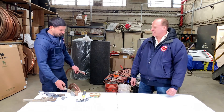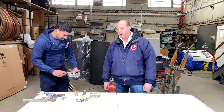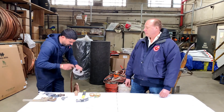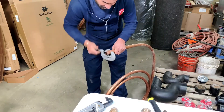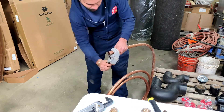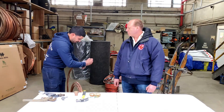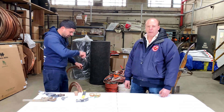The first thing Ramson is going to do: even if it looks like you have a clean end to the copper tubing, you have to cut it. That's a rigid tubing cutter. Even if the end of the copper looks clean, any kind of a defect can result in a leak later down the road. That's why you always re-cut it. And like anything you do in plumbing, it's not about brute force — it's about finesse.